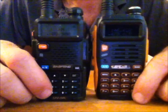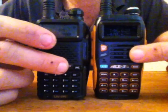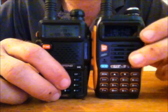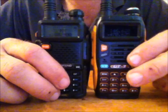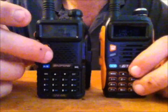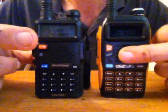Something very interesting I found is the FM radio portion. The band on the UV5R is usually 88 to 108 MHz. On the new GT3 it's 65 to 115 MHz — likely because different parts of the world have different band allocations for FM broadcast. In the 2-meter band it goes 136 to 174 MHz, and in the UHF portion it's 400 to 512 MHz. The UV5R only went 400 to 480 MHz in UHF. So you get a little more frequency coverage with the GT3.